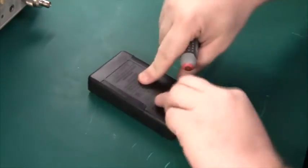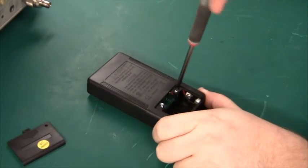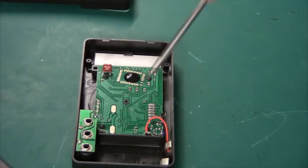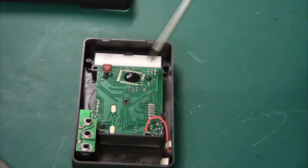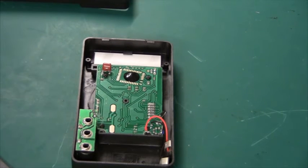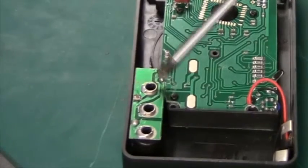Now let's open it up and see what is inside. There are basically just two screws. If we look inside, there's basically a small square PCB with about six resistors, and the chip — which is just a blob top — and a clock generator circuit. There's definitely a capacitor, then a zebra strip and the display itself. The inputs are on a separate little PCB. So it's very minimalistic internally. The only thing is I wouldn't use it for 230 volts or any other high voltage — the PCB layout really can't handle that. The distance between the tracks is just not wide enough.